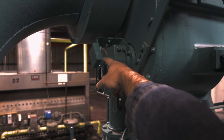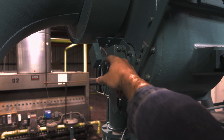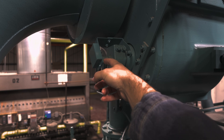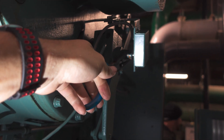All that means is that when we were sliding this together, it twisted a little bit. All we've got to do is back off this front tensioner nut and then slightly turn the rheostat to the position we need it to be. With the allen backed off, we can take our needle nose and adjust that stem to make it read the full 100 position.